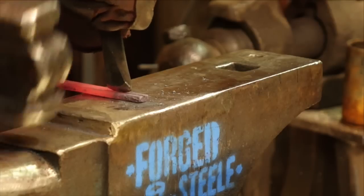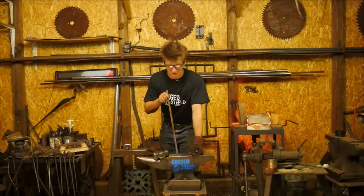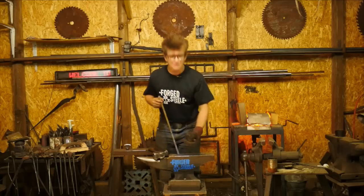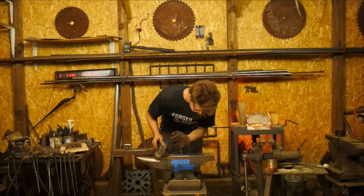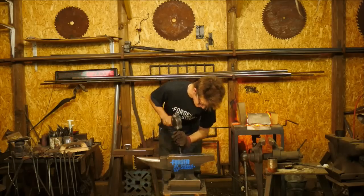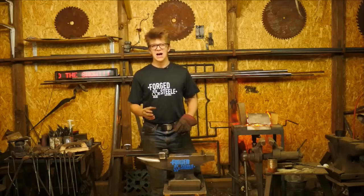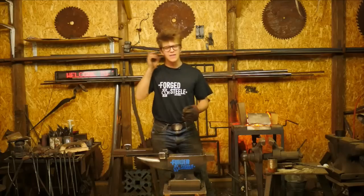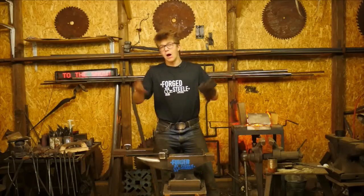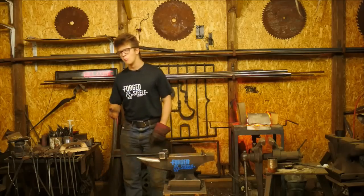I'll often recommend that people lay out all their cuts, their punching, all that kind of stuff at the lower temperatures, for the very reason that you can see I came out of the fire with this yellow and it's now black and I still haven't done laying out my heat. There's no point putting a piece of steel in the fire, letting it get that hot, and using that heat to lay out. On a small piece of steel like this it's not a big deal, but on a larger piece you begin dealing with a hugely incandescent, hugely radiant piece of steel that's radiating a huge amount of heat. When laying out, you're often getting a little bit closer to your material, and that can start to singe you a little bit, which, if you're down for that, then go for it, but I certainly quite like it when it's a little cold. It doesn't put as much radiant heat into the air.